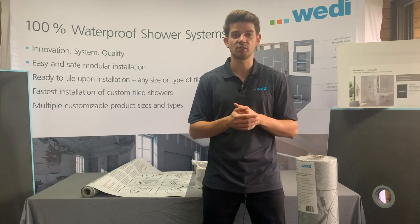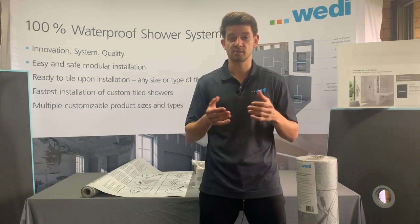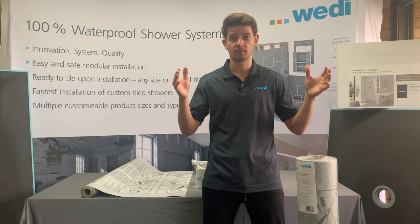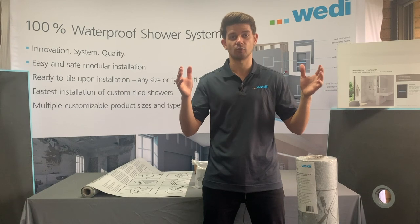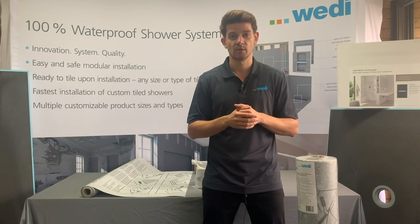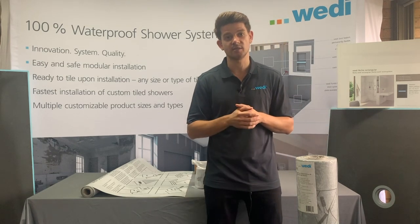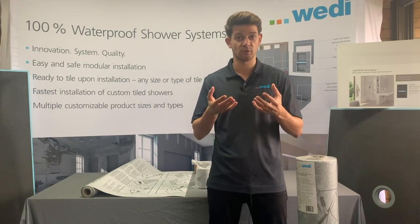After this has been achieved, you're often still facing a seam in your sheet. Our rolls come in 30 meter length and 10 meter length, but also one meter width. So if you have a seam in a larger bathroom, you need to apply our 620 joint sealant in between the two seams.